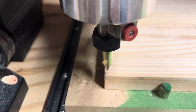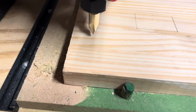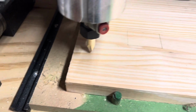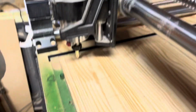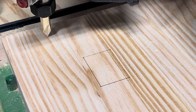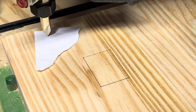So now what I do for a 3D carve is I would bring my bit over to an area that is not going to carve, and then I will lower it down there. I'm trying to find where my paper is here. Let me set this up here. Sorry. All right. So what I would do then is I'll take my little paper trick. I put a piece of paper under there. Follow me so far? Piece of paper under the bit.